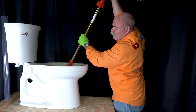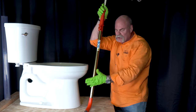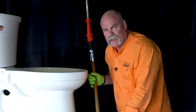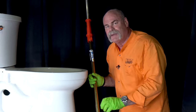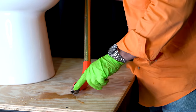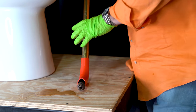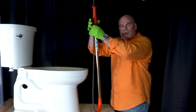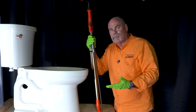Remember how we started with it all the way up inside there — you want to do that again. Now if you're in somebody's house you want to make sure you've got a rag or towel so you're not dripping toilet water on their carpet or floor. Now for one other trick that can come in handy — you've got a spring here on the end. If you go in slow and you're trying to retrieve something — maybe you lost dentures or your readers — you can feel on the other end what's going on down there. You can feel it touch stuff and hit blockages. If you're trying to retrieve something, take a screwdriver and extend your spring out a little bit, or a pair of pliers, just open it up to give it more of a hook to try to grab something. Then when you're all said and done, set it on a towel, pull it up, lock it in position, pick up your towel or rag, put it here and carry this outside. If you have anything on it that you did retrieve or pull out, take pictures of it so you can show the customer.